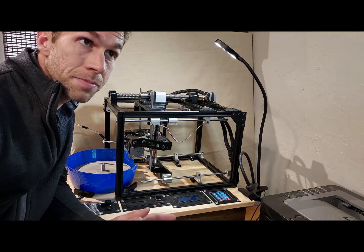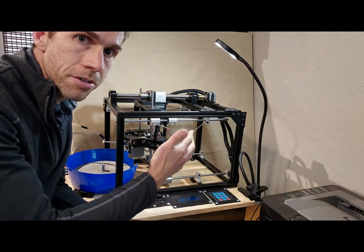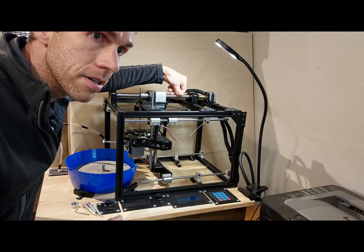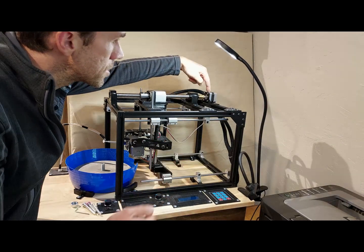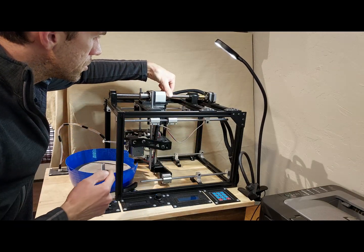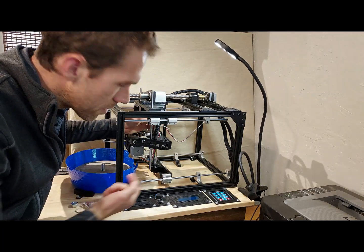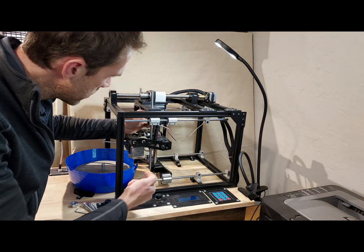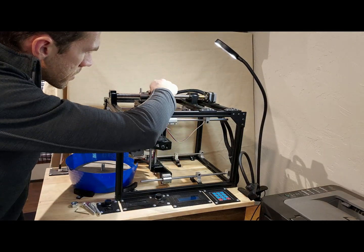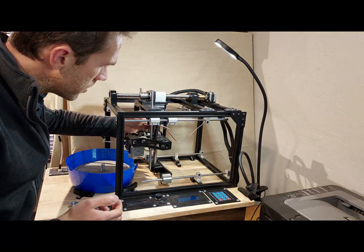The core concept of this machine is pretty similar to a traditional faceting machine. We have different stepper motors here that control different axes of movement. I can control them manually by holding on to the shaft when this machine is not turned on. There's one stepper motor here that controls the horizontal movement, using this screw shaft. There's another stepper motor in here that controls the vertical movement, or the y-axis. You'll notice that this entire platform here is all suspended from the x-axis, so if the x-axis moves, all of the other components move along with it, including the y-axis.